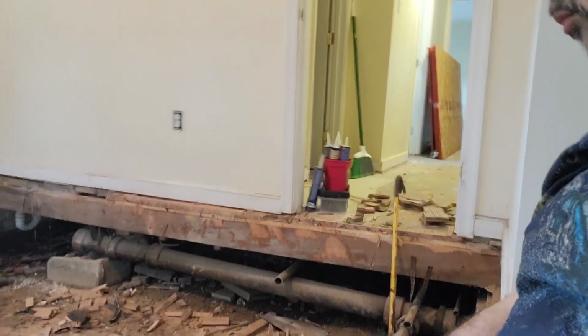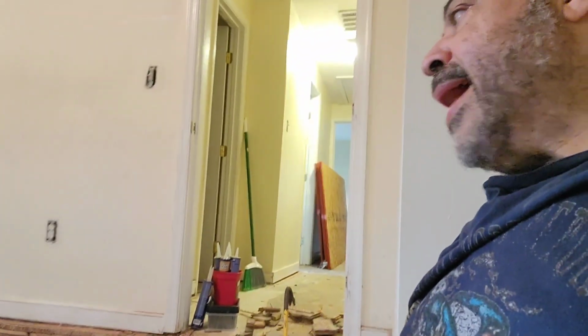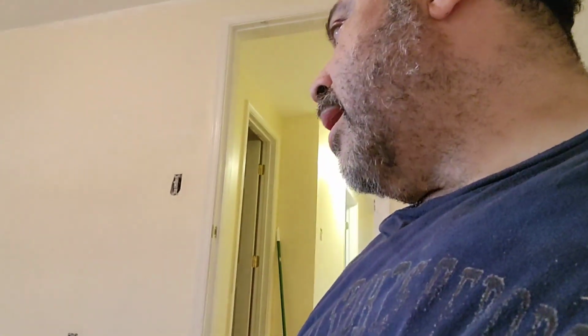And we'll put down a vapor barrier so that way it'll keep the moisture from going out, as an added layer of protection, just to make sure. And probably if this does rot out, I'll probably be dead myself. But we actually got pressure-treated lumber to go up underneath of here. The amazing thing was that pressure-treated lumber was actually cheaper. $3, as a matter of fact, per board for the floor joists. So each one of the 2x10s that we got, 12-foot, were $26 a piece. Still kind of high, but you know what? It's what we need to get this job done.